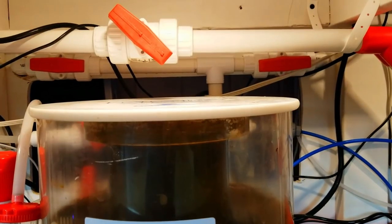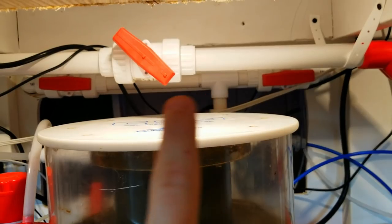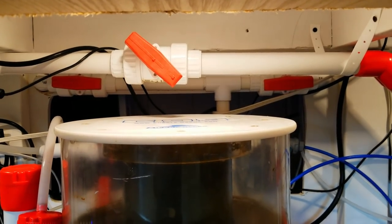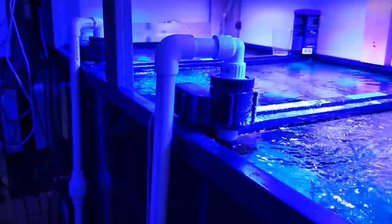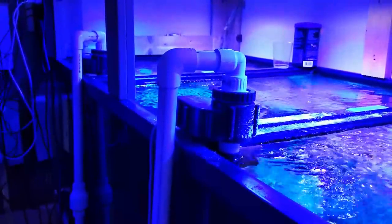From that T, the flow also goes up through a couple more ball valves and around to the backside of the aquarium. It comes up the back through a couple of check valves — which is nice so you don't drain down an inch of a 300-gallon aquarium — and then up to a couple of ocean motions, kind of like sea swirls, which oscillate the water back and forth to give some random motion.